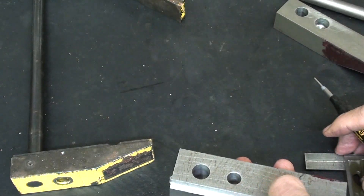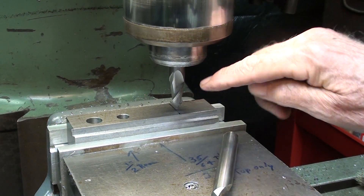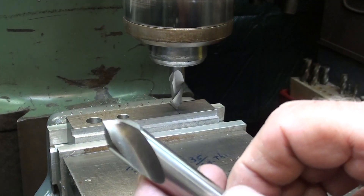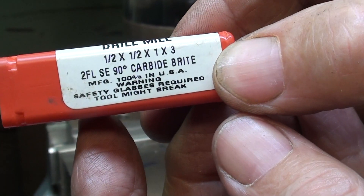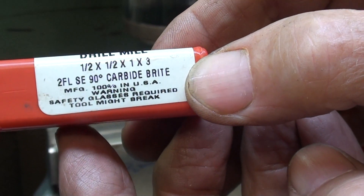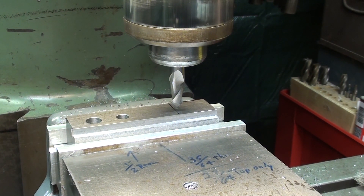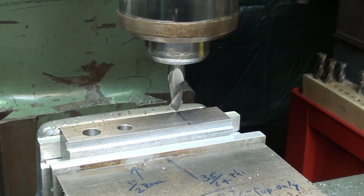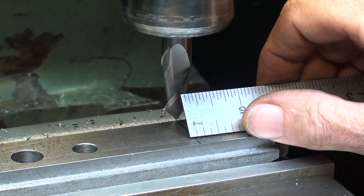The depth is yet to be determined. The workpiece is on parallels mounted above the vise jaw so I do not mill into it. I've got a half-inch cutter shaped at ninety degrees — from KBC Tools, called a half-by-half-by-three-inch, ninety-degree carbide-bright drill mill. I've already centered the table so it's right over my layout line. The location on this is not very critical at all. I'll be feeding back and forth in the Y direction until I get to the depth I want. Rather than going by the depth, I'm going to mill it until I'm about seven-sixteenths wide, and I'll just check it with the scale.